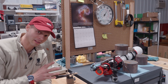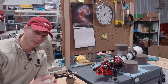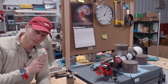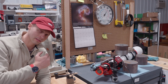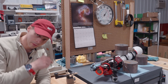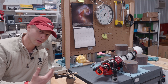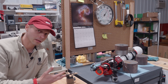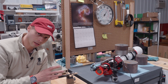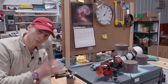We're going to test the whole thing together with the actual rotator in place to see if there's any play in the rotator. I am setting the indicator on the camera body itself, and we're going to push it different directions with a specific amount of poundage — two pounds. We'll go up, down, back and forth, and see how much flexure there is with the entire system in place. Probably at the end we'll remove the camera rotator and do the same set of tests again without the rotator to see if it reduces the amount of flexure.